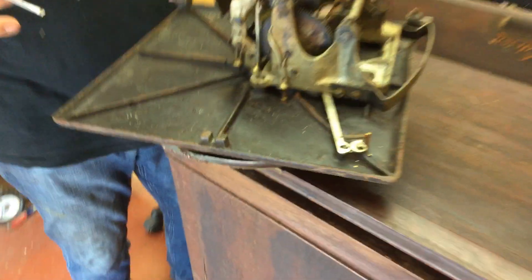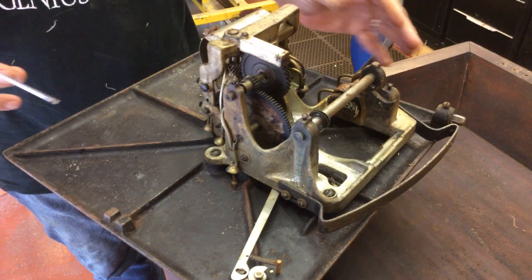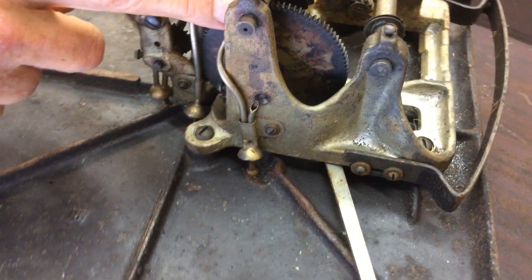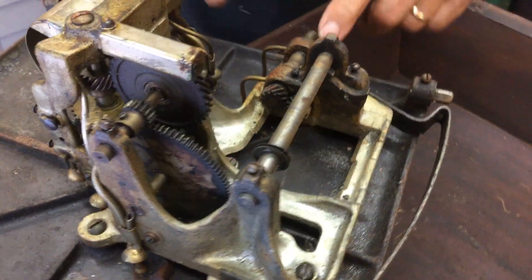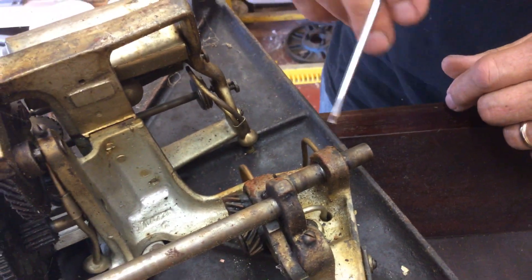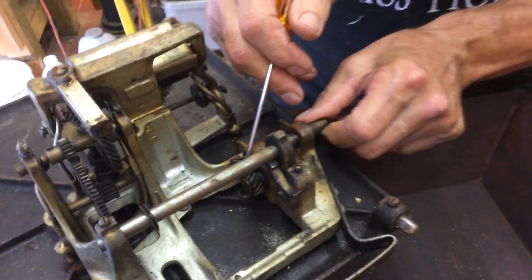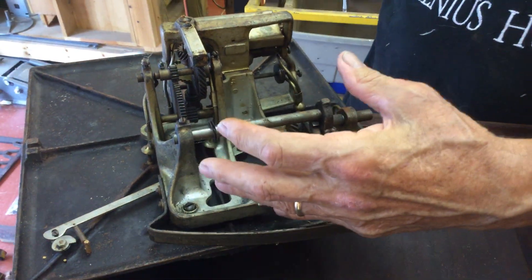These A150 early ones were really unique Edison Diamond Disc motors. Look how beautiful Edison designed the oiling tubes — it wraps around here like that. You never see this on later machines. This oiling tube coming up to oil here and here, another oiling tube coming in here to oil this gear system or the cranking. This beautiful one coming up like this — it's missing the spring barrel.